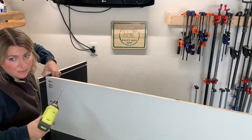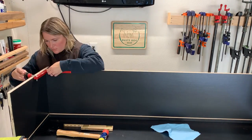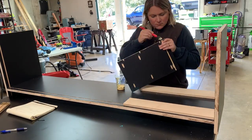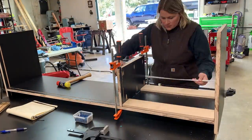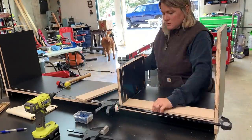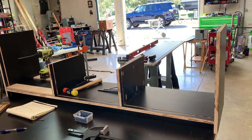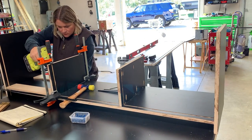This will be helpful down the line when it comes time to adding some cabinet doors. To keep my spacing even, I just used some scrap wood to cut some spacer blocks that I could clamp my pieces up against to give me even spaces for each opening in the cabinet. Once I had my divider pieces lined up perfectly, I added some wood glue and attached them with pocket hole screws.